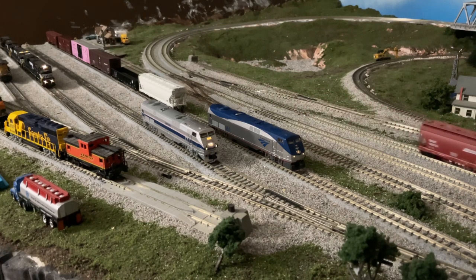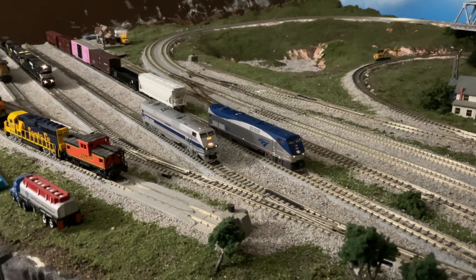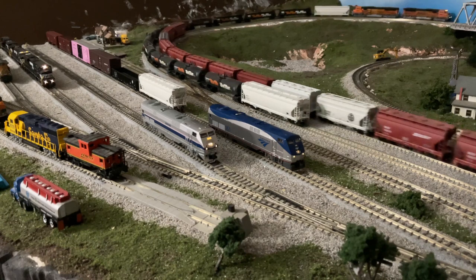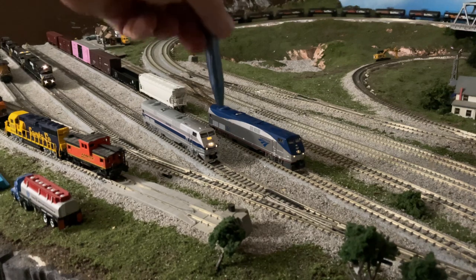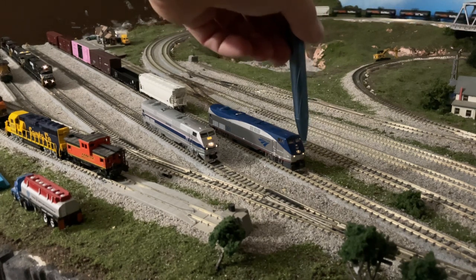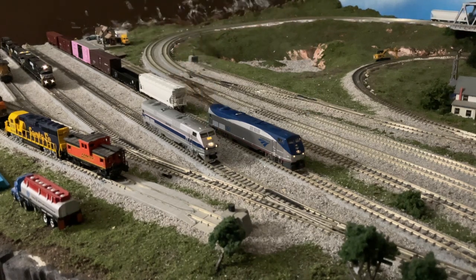Some other changes you might make — if you notice, both of these have slightly different light outputs. When you set your constant dim 1, in the comprehensive programming guide — CV156 is your bright headlight setting. Constant dim 1, which is the Rule 17 dimmed output, is CV64. What you see here is the default value on this engine, which is I believe 5 or 6, and a CV value of 1 over here. I prefer the dimmer of the two, so I will go back and set this one to 1 at some point in the future.